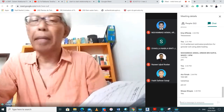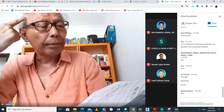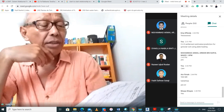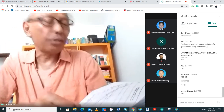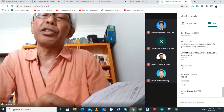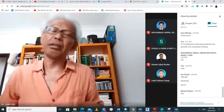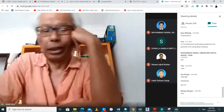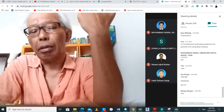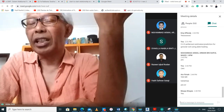So I have my differential settlement from the earlier chart, and then I go into this other chart, which gives you buildings on sand or buildings on clay, and it will give me the maximum angular distortion. So now you know basically that there is this chart for you to get your differential settlement and your angular distortion, having known what the definition is.